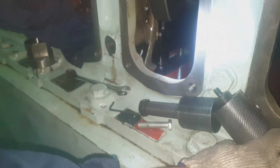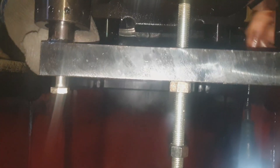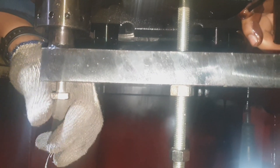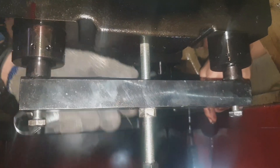This is the extension I'm holding — the extension of the main bearing cap stud — so that we can drop down the lock nut of the main bearing cap a little more. We have to detach the pulling tool of the main bearing cap and then insert the extension of the stud so that it will catch the main bearing cap without it falling down or getting damaged.